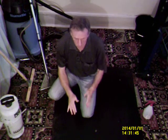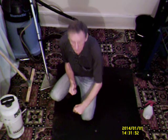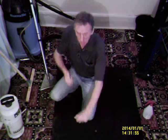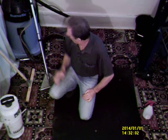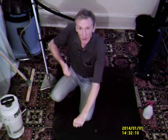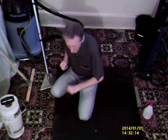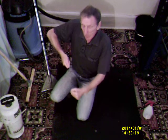The idea of this, with the machine, is to lower and higher, like I think you saw me doing. When I pushed the machine forward, I lowered the machine. And then as I brought it back towards myself, I raised the handle and brought it back this way. And then lower and push forward. And when you push forward, you don't have your trigger spray pressed. Only have your trigger spray pressed when you are actually bringing the machine back towards yourself. Then release the trigger and lower the machine down and push forward. And then raise it, press your trigger and bring it back towards yourself.